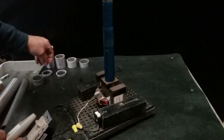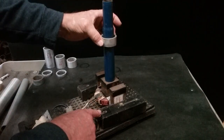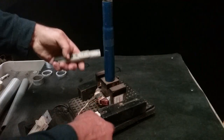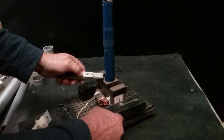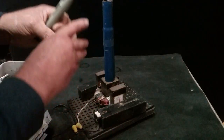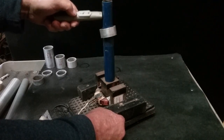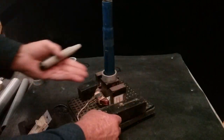Now I'm going to take a short three-quarter inch aluminum ring and float it — let it levitate. But first I want you to see what the magnetic field does on the steel pipe. With nothing on it — no aluminum, nothing — it alternates all the way to the top. Now I'm going to let this levitate and see what happens. With the aluminum ring it kind of dies above it — there's a little bit up here, it's always good down below, and it will eject it.